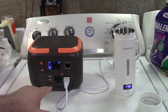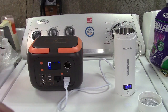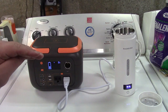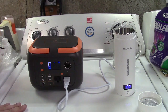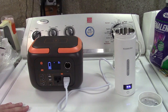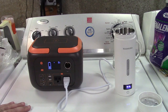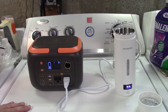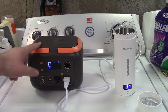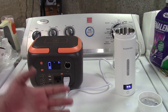So you want to always size your equipment higher than what you're going to be doing. You want to exceed that margin — well over. Buy based on performance for what job you need to accomplish, not based on price. That's kind of the point. And yes, it was successful in this head-to-head competition — but only barely viable, because it's undersized. Now I have another power station here that's 600 watts. And being that this kettle only draws 300 watts, I'd only be running at 50 percent capacity. It could run for quite some time doing that — certainly a lot longer than this 300 watt unit. It's more suited to the application. That's the whole point of this exercise and this video.